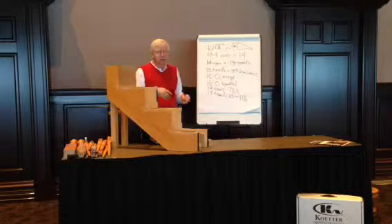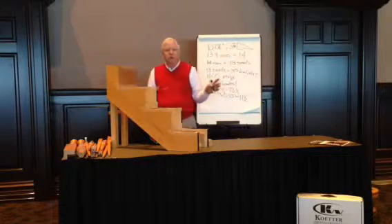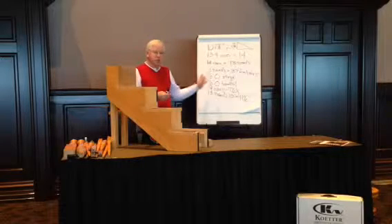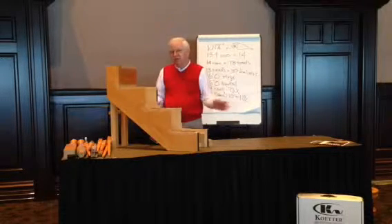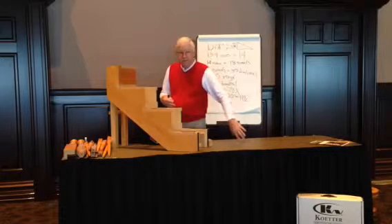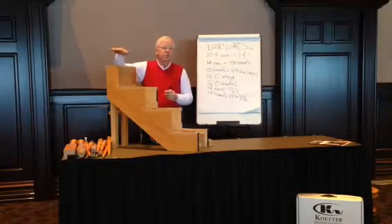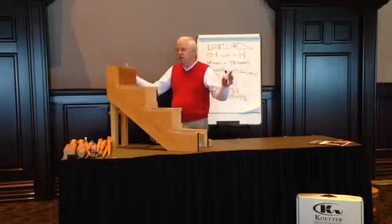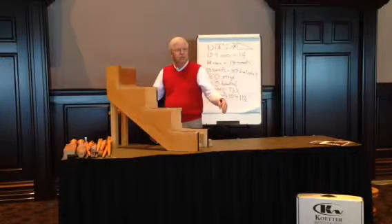This also tells us how much horizontal space we need for the stair. That horizontal run would be 10 inches times the number of treads — 10 times 13 treads equals 130 inches. When looking at a set of prints, I always take the calculated run and add 12 inches to that. We need room for the nose overhang, room to allow a swinging door to pass, and approximately 6 inches on each end for clearance from adjacent structures. So for a rise of 107.5 inches, a run of about 142 inches would give us room for the stair.